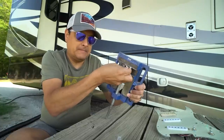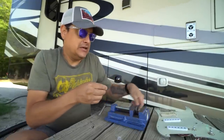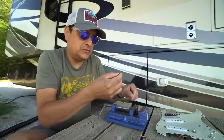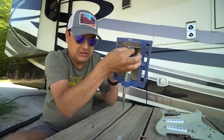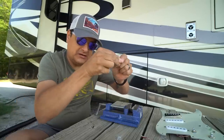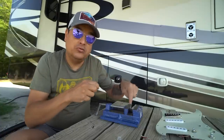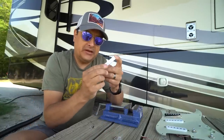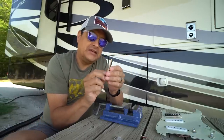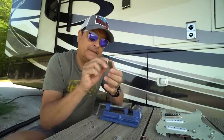So that magnet wasn't magnetized and now it is — you can see it picks up metal. Depending on which way you face it going through the magnetizer, you might get north on one side and south on the other. Flip the magnet over and run it through the same way, and you get south on one side and north on the other. You control the polarity by how you orient it. Now, a humbucker uses a bar magnet — magnetized edge to edge. This alnico 5 bar magnet has a north side and a south side.